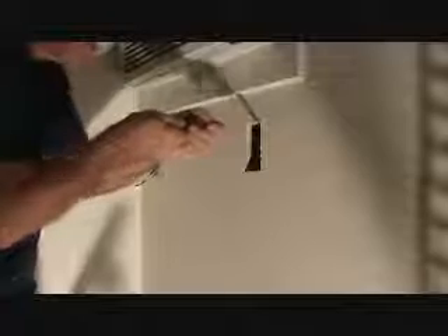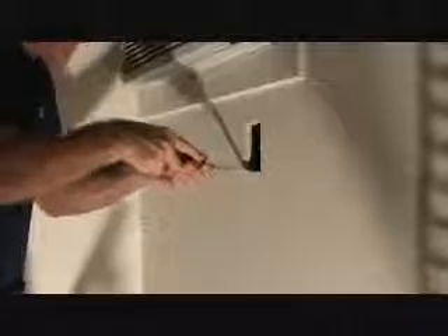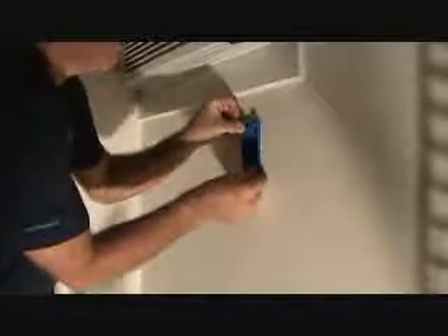Just a little — it seemed like it was hitting down here too, so I'm just going to take off a little bit. You don't have to take much. I want this box to fit in there fairly tight. I don't want the top and bottom too far off because the tab is only about a quarter of an inch long, and that's all that holds this box to the wall.